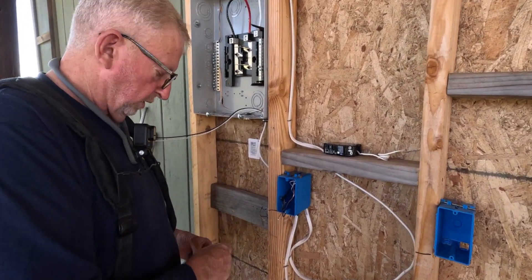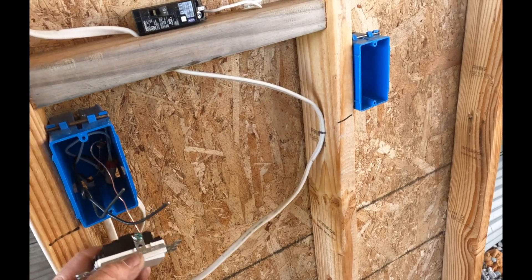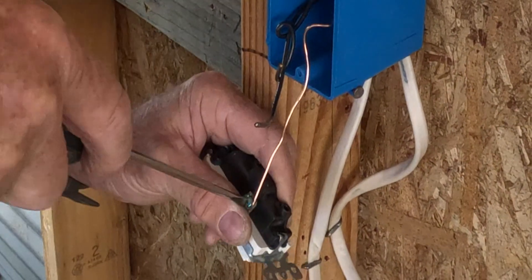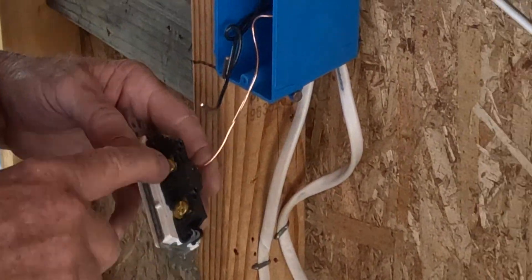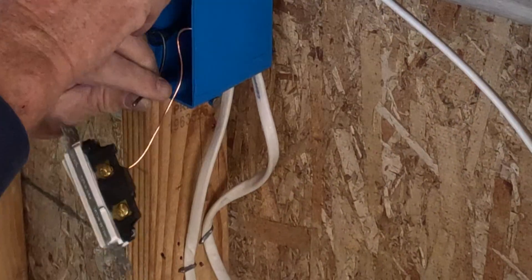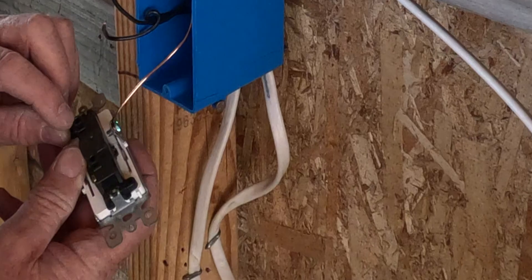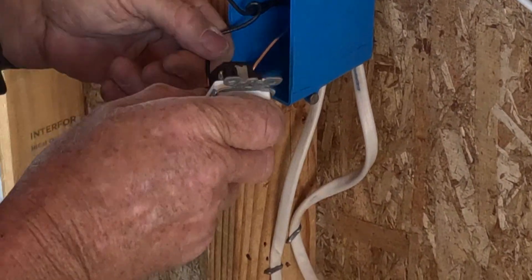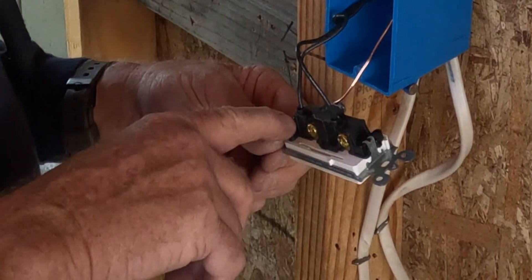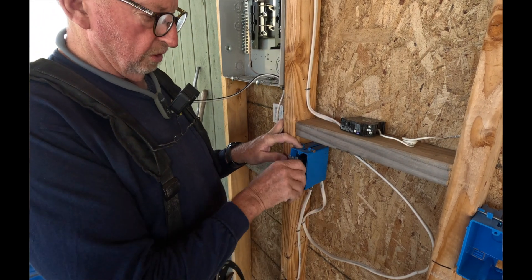On this switch there are two ways of doing it. First we have to install the ground. There's two ways: we can wrap the wire around the screw, or on small loads I'm okay with using the compression connector in the back, because nowadays the lighting loads are so minimal. Just install it like that — push it in all the way. It gives you a wiring gauge right there. Then you get your two 6-32 screws and screw it in after the drywall is done. We'll leave the switch off for now.